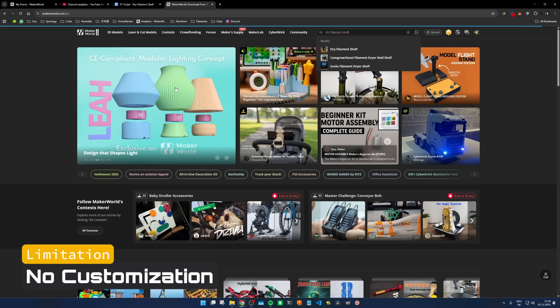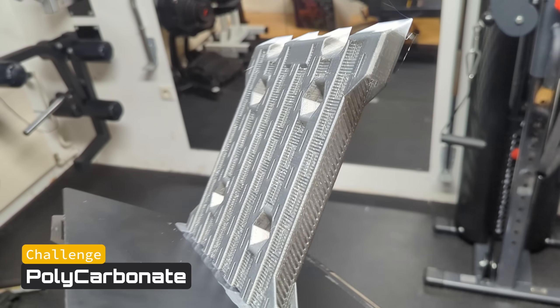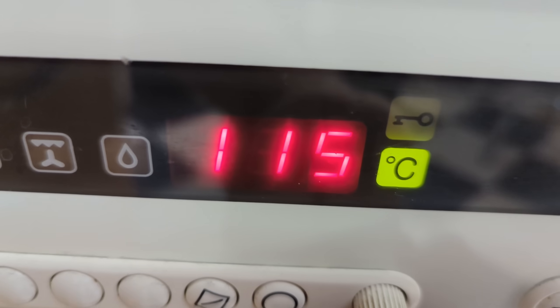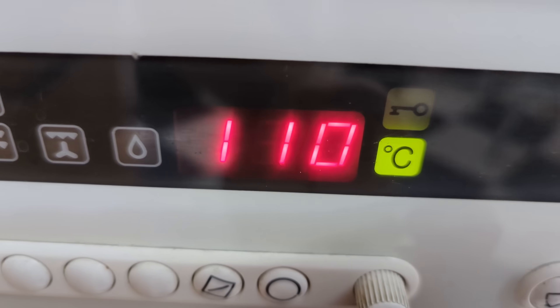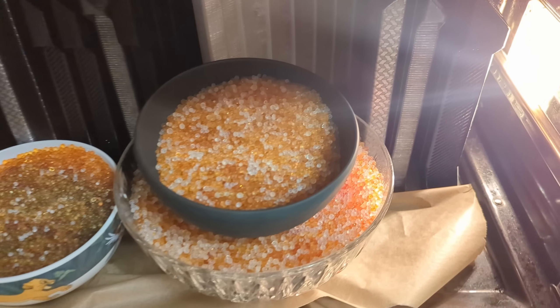Think of it as a small long-term investment for years of perfectly dry filament. There's no customization options this time. The current design with standard and jumbo options should cover most common spool sizes, but if you have something truly unique, challenge me — drop a comment with your spool size down below! The Lazy Man's PC desiccant compartment is nice, but it comes with some risk. If you have an oven temperature that jumps plus or minus 20 degrees Celsius like mine, your compartment could deform.